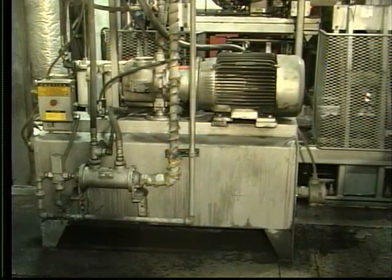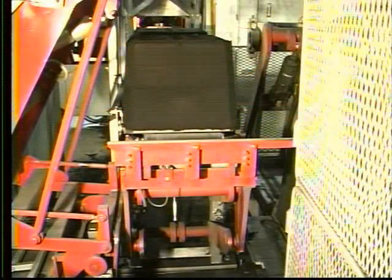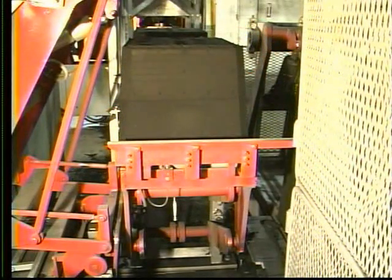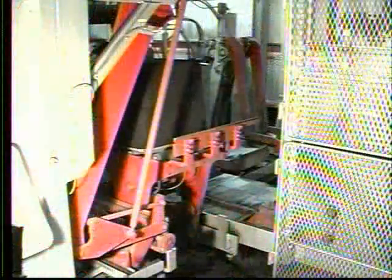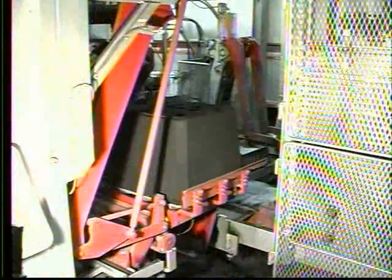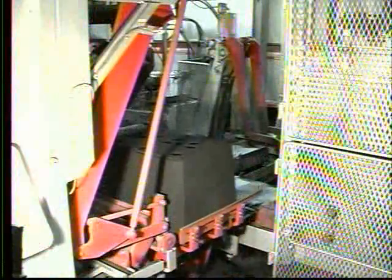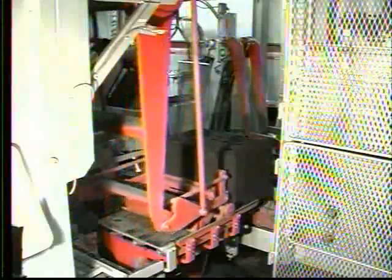Hunter linear mold handling systems have a dedicated hydraulic system. At the end of the accumulating conveyor, the mold is lowered to a position 18 inches above the floor, and then is pushed off the aluminum bottom board onto the graphite-covered pouring car.